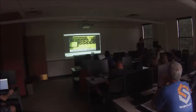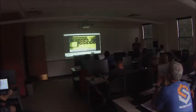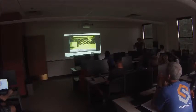So the one that we get to use can cut up to 1 inch and a half? 1.25 inches. Or actually, the one that we have access to can do up to 7/8 inch steel. Again, aluminum and stainless steel are a little harder to cut just because of their optical properties. They tend to reflect more light, because you're cutting with light, right? So you can't cut as thick a material in aluminum or stainless because of its optical properties and thermal properties.